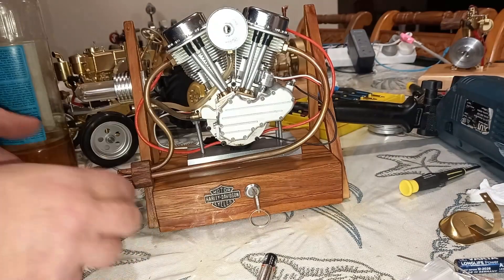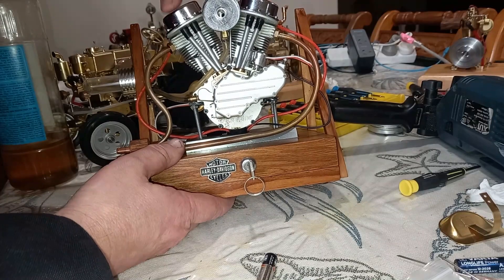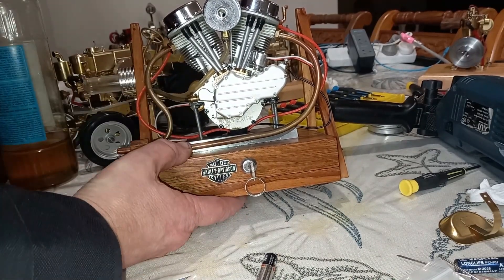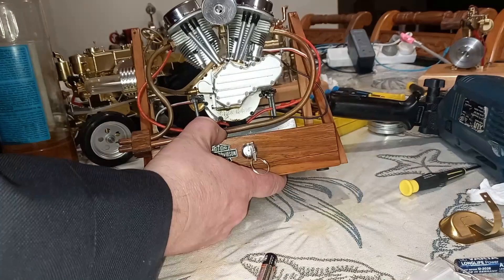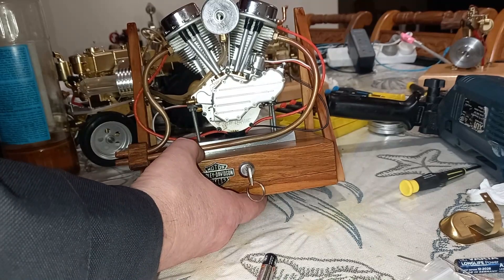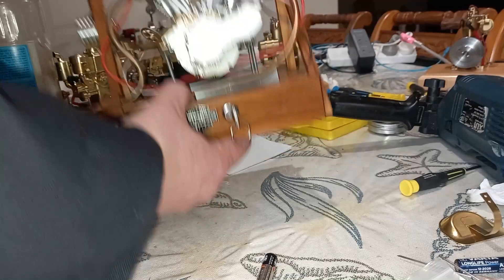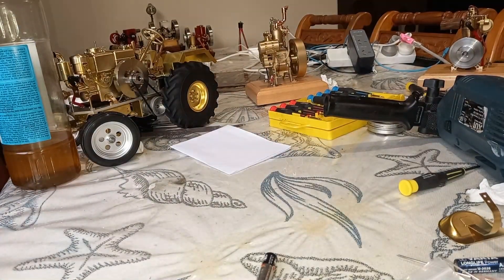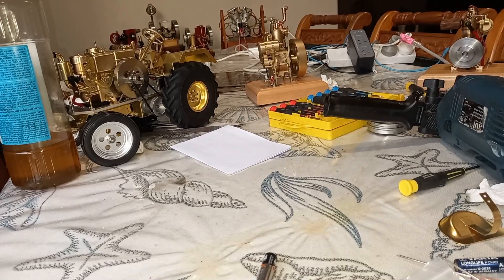The box and the frame and the petrol tank and everything is mine. I've had some issues with this — ignition failing and the hall sensor failing. I've soldered up another hall sensor, got it behind there, and this is running. But we have one cylinder with great compression, no issues, and one with pretty crappy compression. So I still have to work on that. Are we today going to get a V2 model gasoline working model engine with no issues at all? Do you think that's possible?